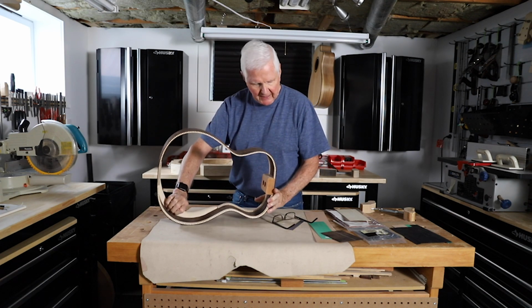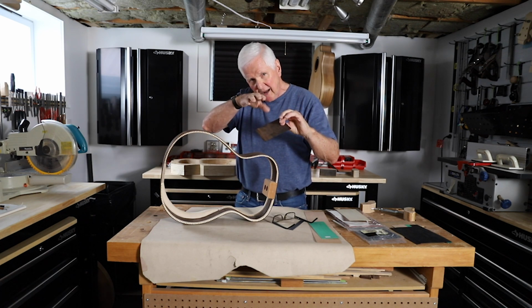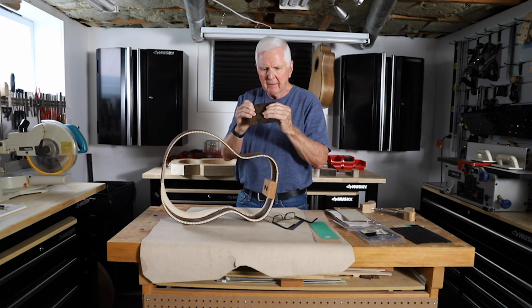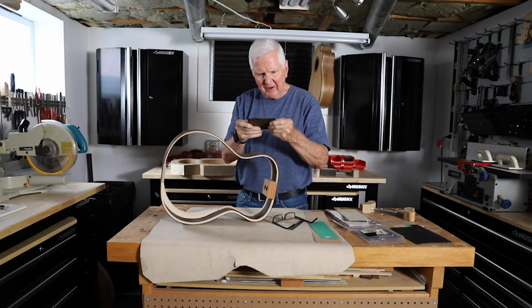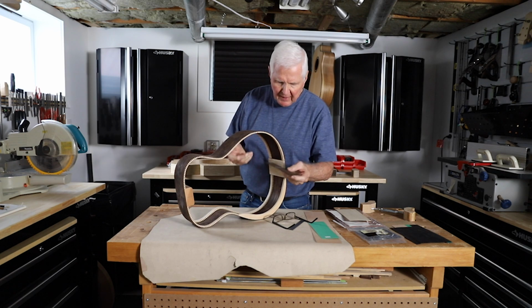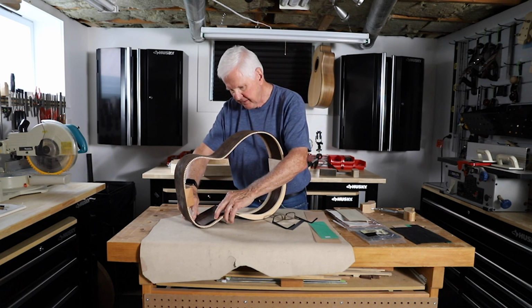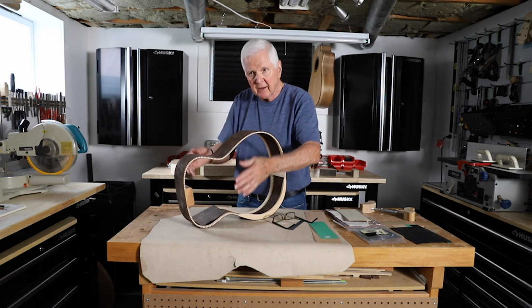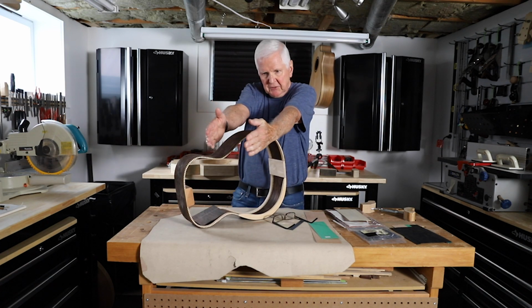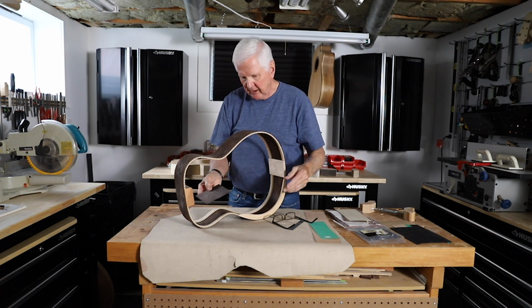In the meantime, what I did is I used the Super Soft on this piece of wood that was kind of wavy, and then I clamped it between two boards and flattened it out. I have now taken this wood and I set it up in here, and I drew a line from this end to this end because it's on a taper like this, right? It's coming in like that. So I've drawn my line, I've got it all set and ready to go.